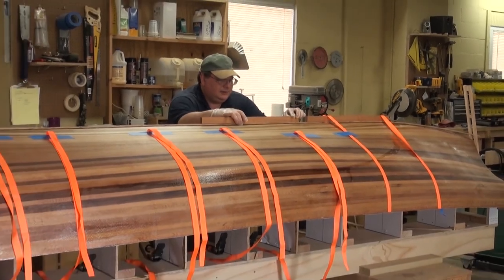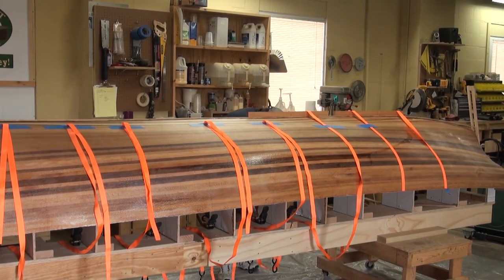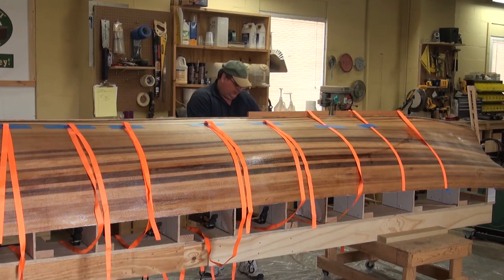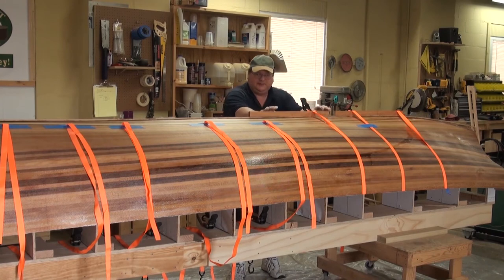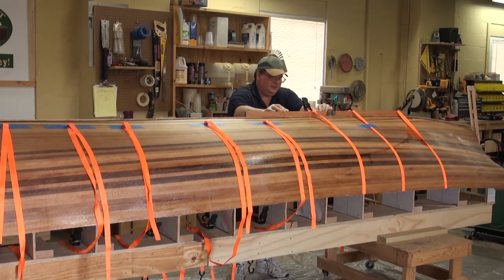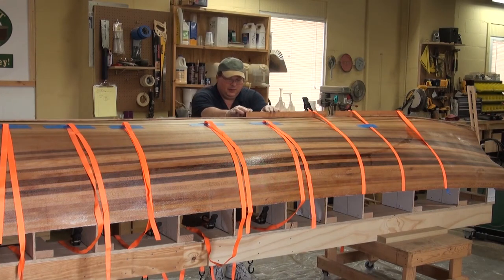Continue down and watch the edge of that tape — make sure you're lined up well. This is one of those jobs where you just need to take all the time you need to get it done right. Don't walk away from this boat until you are absolutely satisfied that it is straight and where you want it, because once it's down you're not pulling it back up — if you want it off, you're going to have to grind it off. The reason for these blocks is to even out the pressure so I don't need 30 little straps going down. If it's rocking or pivoting one way, just slide the board forward or backward to correct it.